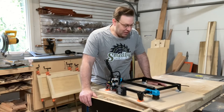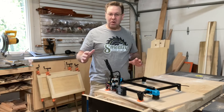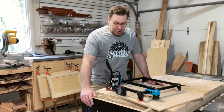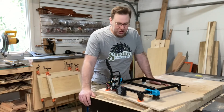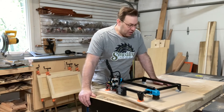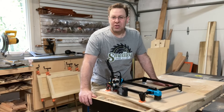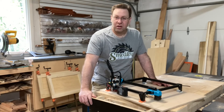Let's go over this Two Trees TTS-55 laser. I've got everything put together, done a couple of test burns, and it works fantastic as far as I can tell. This is my first laser, so I don't have anything to compare it to. But I can speak to the build quality of the machine. It's got aluminum rails, which is great. All the other parts are plastic, but I don't see an issue with that because there's no load when it's running — it's just moving the head back and forth and burning. I added limit switches so it can home to the front corner. I have some 3D printed parts that those limit switches are attached to, which I found on the EC Treasure Hunters YouTube channel — I'll put a link in the description below.